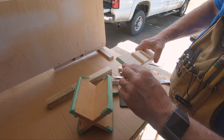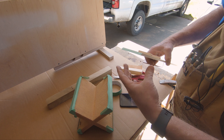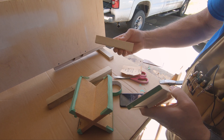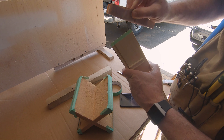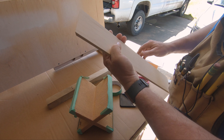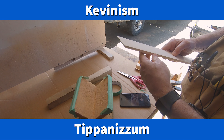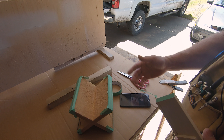Go ahead and assemble the whole thing, tape everything together on the edges, put some green or blue tape on the edge, and then just sand it lightly — you've got to have a block of wood so it's nice and sharp — then sand it with 320, just a light little sand job, bump bump bump, and it comes out pretty good. That's a little Kevin-ism tip for you. We'll see you soon, bye.